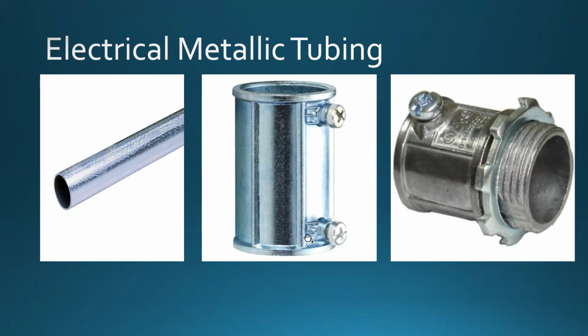Now, when you're installing a security camera, you'll be having this thing not against the wall, hanging somewhere in the middle of the room. And sometimes people just tighten the set screw, run the wire, there you go. You're running the danger of putting people at risk of getting hit by the camera, because those are not meant to hold the weight. Again, I'm repeating that, it's just for alignment and the aesthetics of installation and that type of functionality.